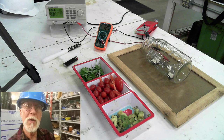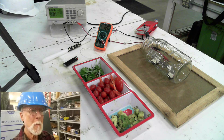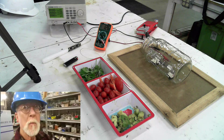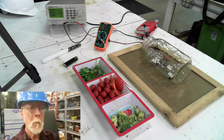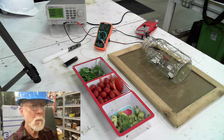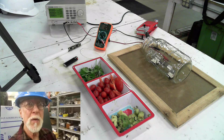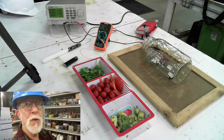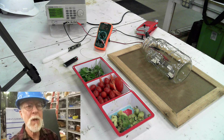And, Bob, we concluded something important. Yeah, I think that you need to really understand the material before you're going to be able to use emissivity values. And also the reactor that you're going to be using needs to be basically heat treated to the temperature it's going to operate to. Otherwise, you're going to have it maybe changing its emissivity during its working life. Well, further testing would be needed, but I think it seems like a permanent change happens to the material. To test that, we would have to go back and start looking at emissivity at lower temperatures after it's been cured. If we find that the emissivity change is permanent, then pre-baking at the highest anticipated temperature would stabilize it, and then you could get meaningful temperature values of it through the entire range.